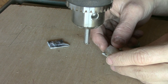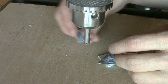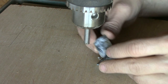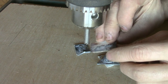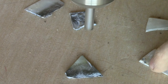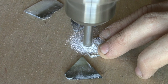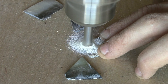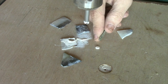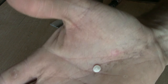When picking out pearl, it's important that you have as little of the shell on it as possible — not the actual pearl, but the outer shell — because that's more prone to cracking and won't yield very good dots. After you cut it, you'll need a little screwdriver or something to get the dot out, and with a little bit of sanding, you have a perfect dot.